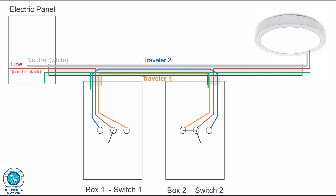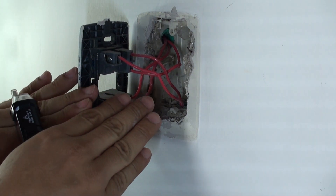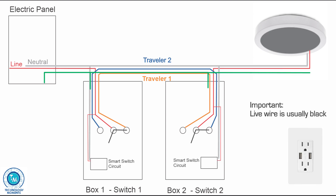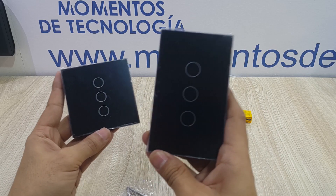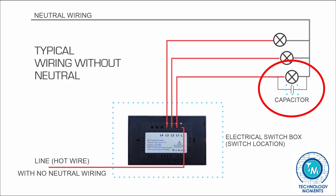In a more realistic wiring diagram, you have two electric boxes — two locations like upstairs and downstairs — where the live wire and the travelers reach each box. If you're lucky the wires will have different colors; if not, you may end up with all the same color, which has happened to us many times. The final realistic situation includes a neutral wire, mandatory for this switch model, and an optional ground. There are other options on the market that don't need a neutral and use a capacitor, but in our experience they've been quite troublesome.